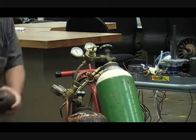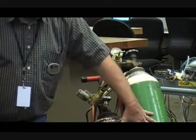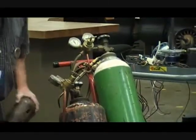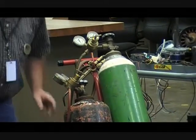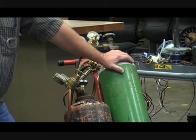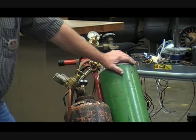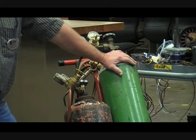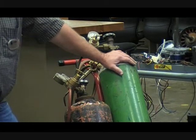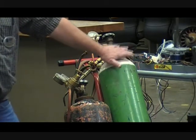The cause of that: when you haul these tanks, you should have the safety caps on — this protects the top. You notice these tanks are in a rack. When you have these tanks, you cannot leave them standing up in the middle of a room. With the safety cap, they have been tested — dropped off a six-foot dock — and they survive. It is a policy of many tank manufacturers to tell their workers: if it falls, let it fall. Don't try to catch it; you can do damage to your back. But it shouldn't fall if you've got it in the proper device to haul and store it.